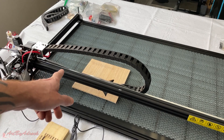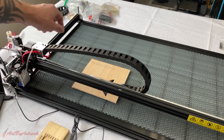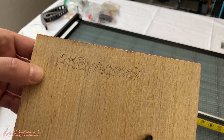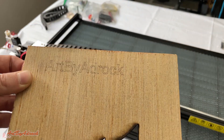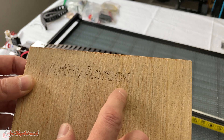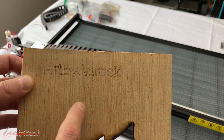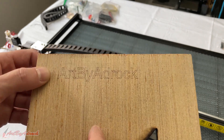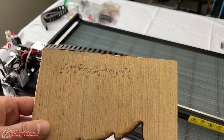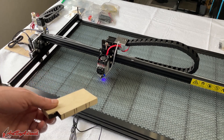I'm going to run this at a speed of 3000 and 40% power. After it finished, you can see it comes down to the bottom left instead of going back home to the top left. The result is a nice fine line — I think the focus is pretty much spot on. I can adjust speed and power settings to make it a little darker or crisper, but I'm happy with that.